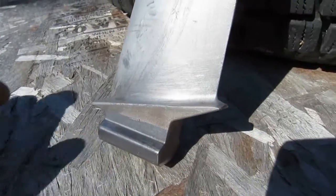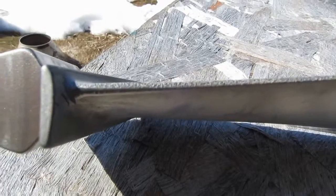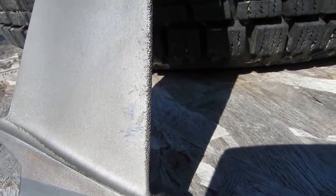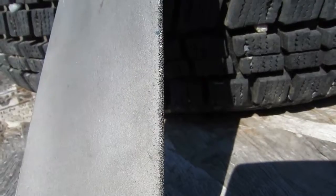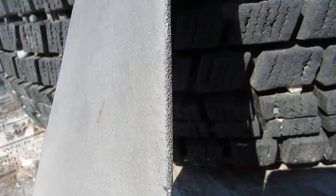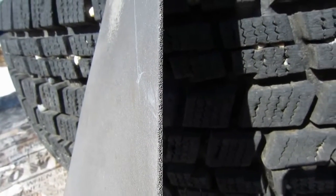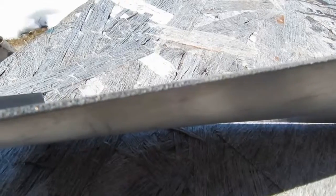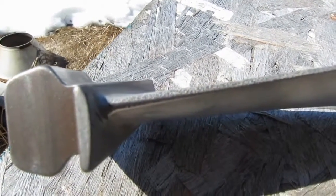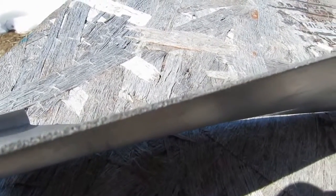There's another very good example of what happens. This can't be repaired. What can be repaired, up to a limit, is the leading edge of the compressor rotor blade. And you see that rough texture with all the little pits and holes and moon-like surface? You see that leading edge? All the pockmarks from tiny particles of solid debris, sand or dust, smashing into that at very high speed. This is a solid stainless steel blade, so you can get an idea of the energy and the speed of this thing. 7,200, 7,400 RPM. To repair this, all this would have to be filed away and then repolished to a nice smooth leading edge of the airfoil. This one could be fixed, but because of the root wear, we junked it.